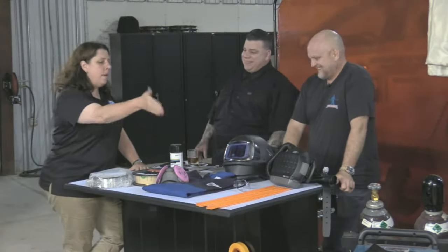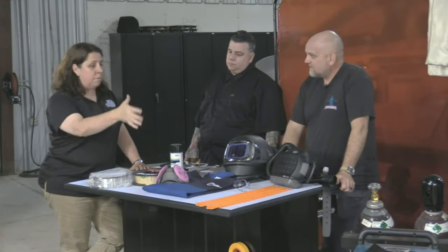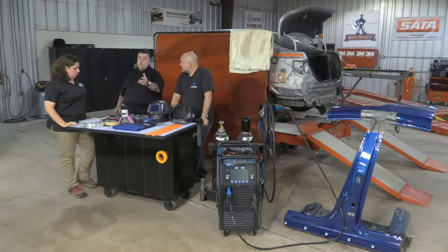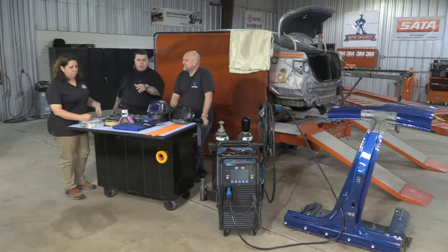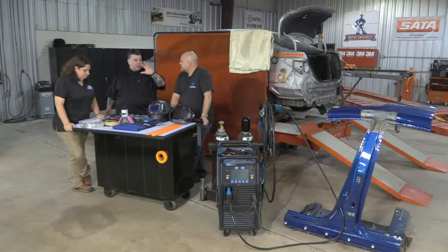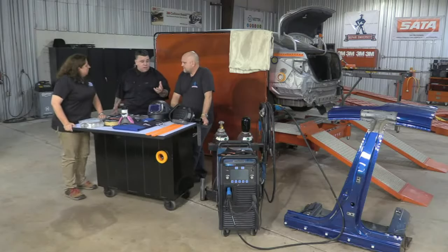But that welder might have worked perfectly yesterday, and then today, for some reason, there's a problem that I don't know about. Listen, there are times where you get bird nesting in the wire. The wire could be near the end of the big, huge spool they're pulling it off of. You could get a bad spool at the end, and all of a sudden it bird's nests.